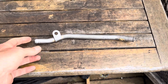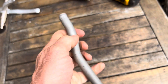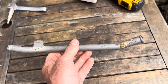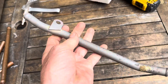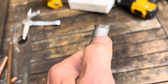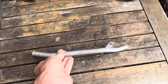In this video I'm going to show you how to make up a complicated metal pipe like this, showing you how to get the brackets on, how to get the beads on, how to get the bends in there, and also how to give it the OEM look by powder coating it. This particular pipe is from a 1975 Mercedes 280SL - it's no longer available from Mercedes. It's been repaired previously, brazed, but it's got holes after sandblasting and the ends are too damaged to make it worthwhile trying to repair the existing pipe.